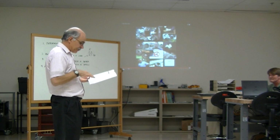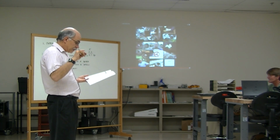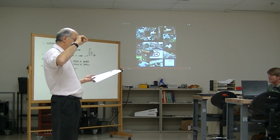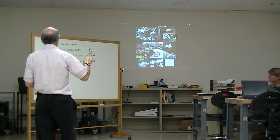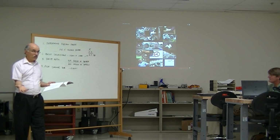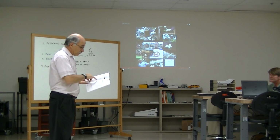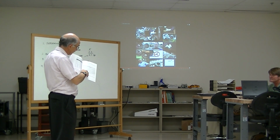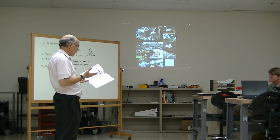So when you use that sheave diameter chart, part of the step tells you that you've got to calculate the size of the larger sheave, and you do that by multiplying the small sheave diameter times the drive ratio. So once you know the drive ratio and you've picked the smaller sheave, that tells you what the larger sheave is. Right? The smaller sheave diameter times the drive ratio. In this chart, you have the RPM of the smaller sheave on the left. Let's say in this application my RPM was 2,000.